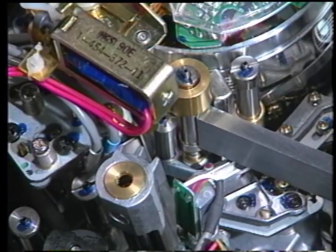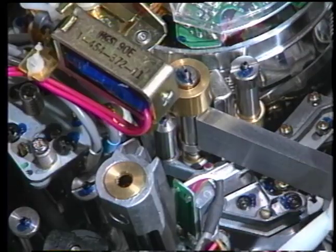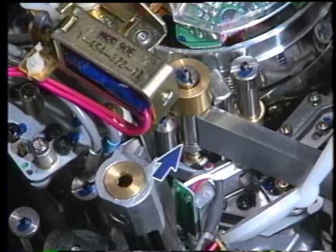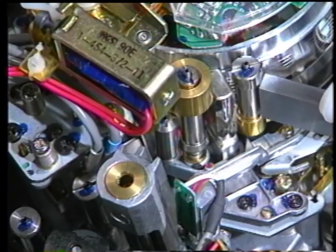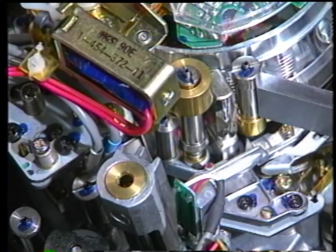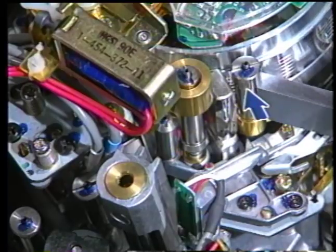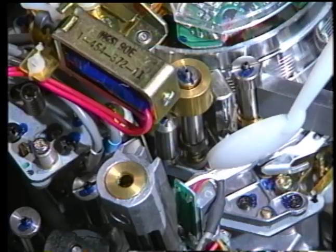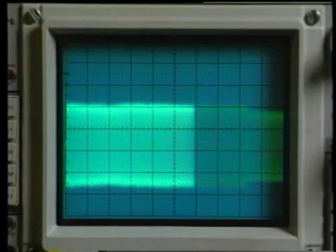TG1, the tape guide between the CTL head and the tension regulator arm, should just contact the bottom of the gauge block. TG2, the tape guide at the entrance to the video drum, should contact the top of the half-inch tape simulating gauge block. These settings will provide a good basis for performing final adjustment of these 3 entrance guides while viewing RF envelope.